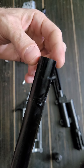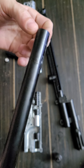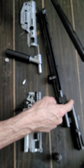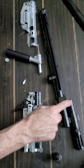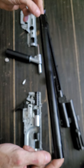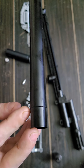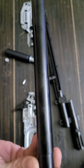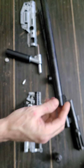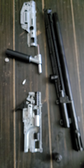I'm pretty sure the Lapco barrels, even the A5s, will just slide right in too - I don't think there'd be any harm, but I'm going to do another video to check that out soon. Obviously this tip part doesn't detach, so somehow you're going to have to remove this tip or cut your barrel to this length. If you try to put a Lapco barrel in you'll have to cut the end off and might have to grind something like this into it. You could use a drill or milling machine, or hold sandpaper against it as it's spinning, or a file. That's the barrel - it's not as long as it looks.